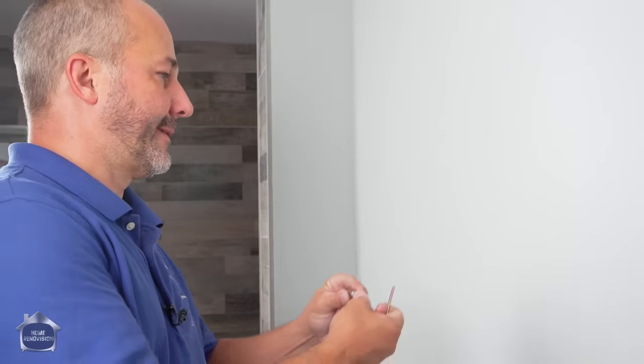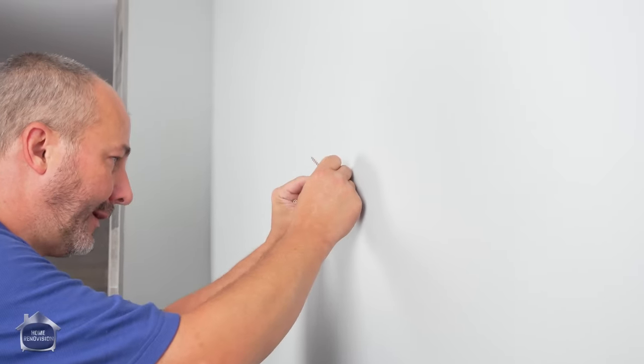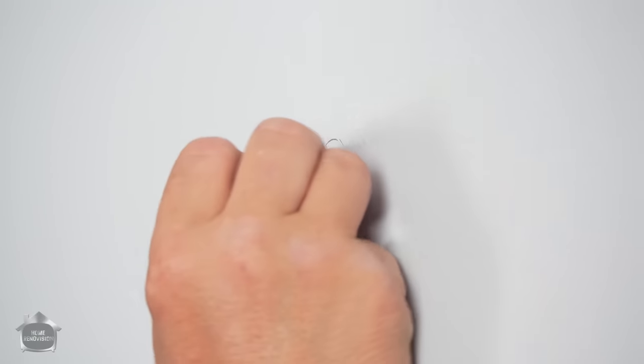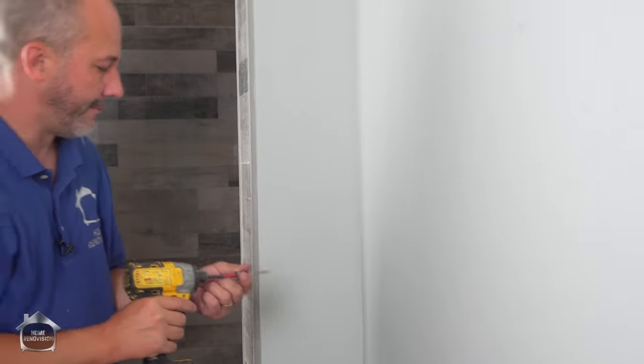And that's why. Okay, we're gonna take our thimble now. We're gonna reverse it, put the fat side against the wall, center on your pencil marks. Take your screw, pass it straight in, puncture that drywall. Wow, that was a lousy shot, eh? Even I know that wasn't the middle. Okay. It's just a matter of screwing these on and we're good to go.